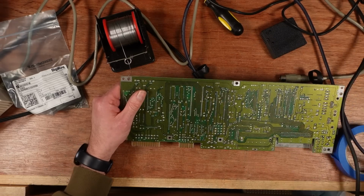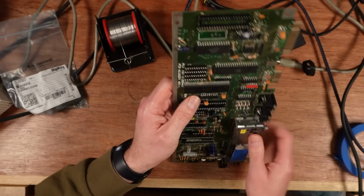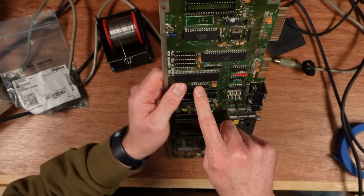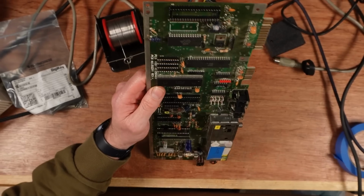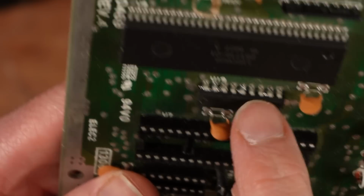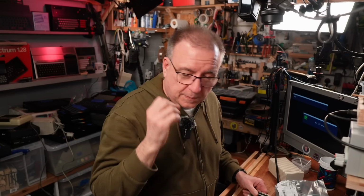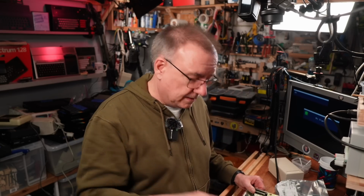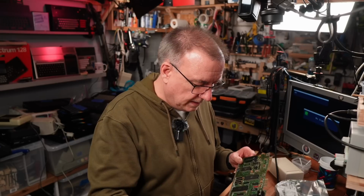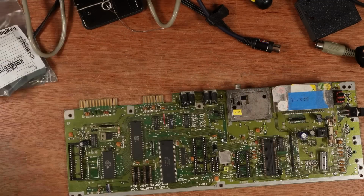That's much better. This could have been me experimenting with my desolder station, with my Hakko desoldering gun. I don't know if you can see, but there's a lot of solder here in between the legs. And what was happening with my Hakko, it was blowing before it was sucking. So yeah, I'm going to have to heat this from above. Yep, let's get the hot air station.